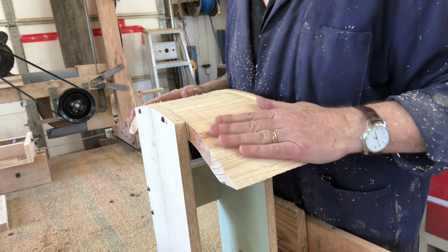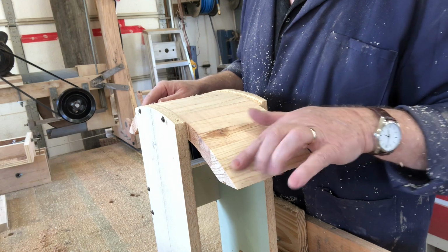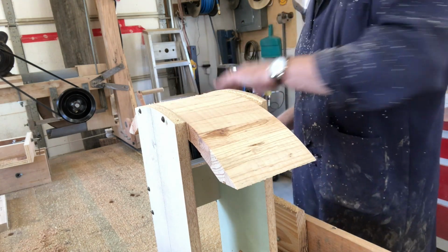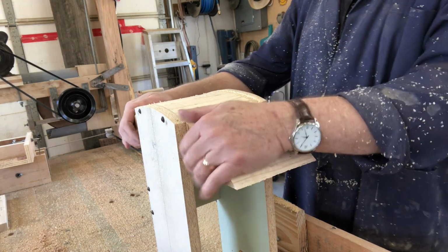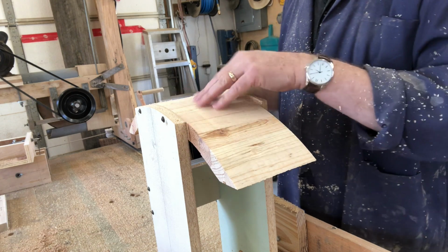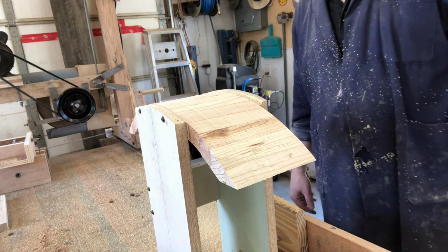All right, having made that pass, I'm gonna do one more just to take out this low spot, and there's a little bit of a low spot here. But after that, I think we're good, and we'll then be ready to try and tackle some reeding, or beading rather, that's gonna be interesting. All right, one more adjustment.